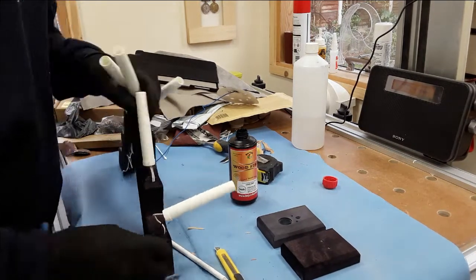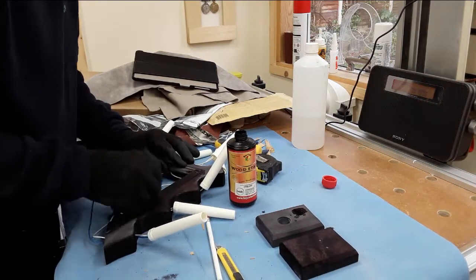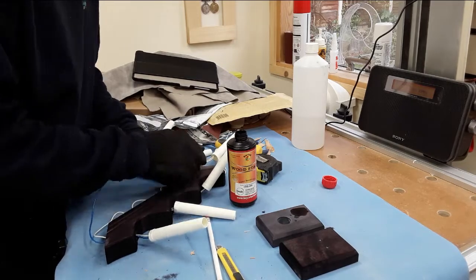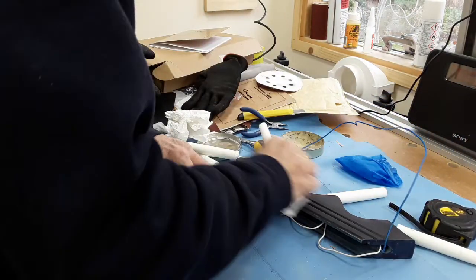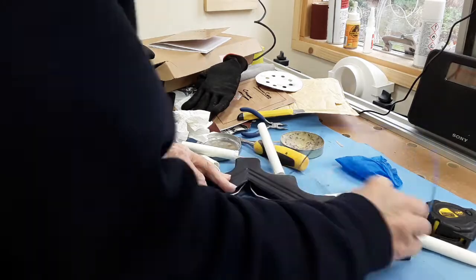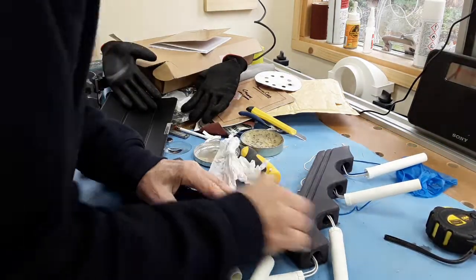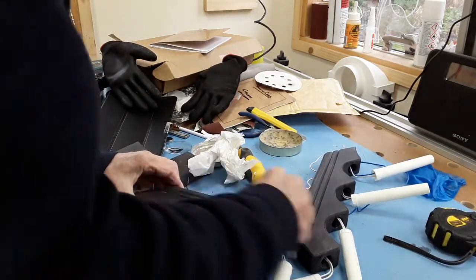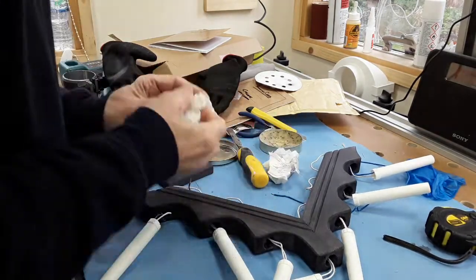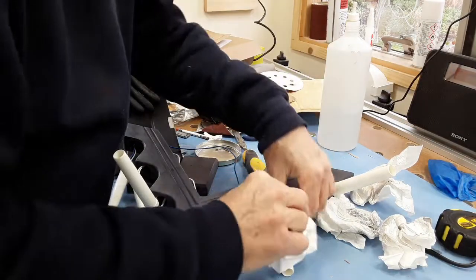It just basically filled most of the grain and raised it a lot. It needed knocking back with a little bit of sandpaper, but when I put the second coat on, it really came in as a nice deep charcoal. And then I dug out the beeswax, gave it a polish up with that, which has brought it out into a nice sheen. And again, most of the time was taken fiddling around with all the grooves and odd corners of this thing, because it's not an easy shape to do a lot with.